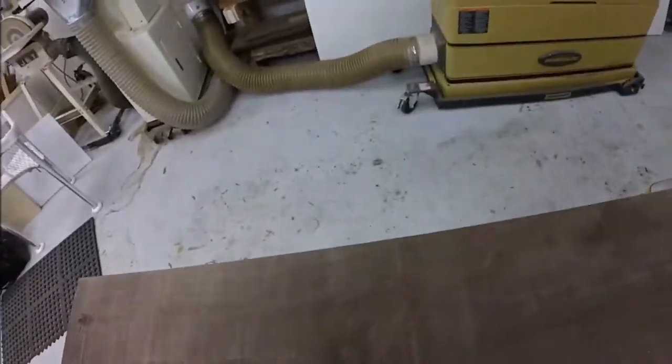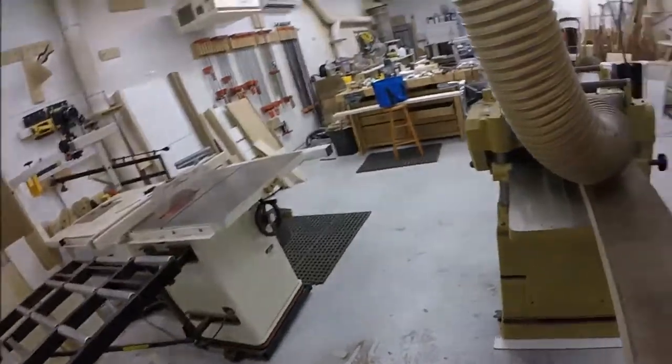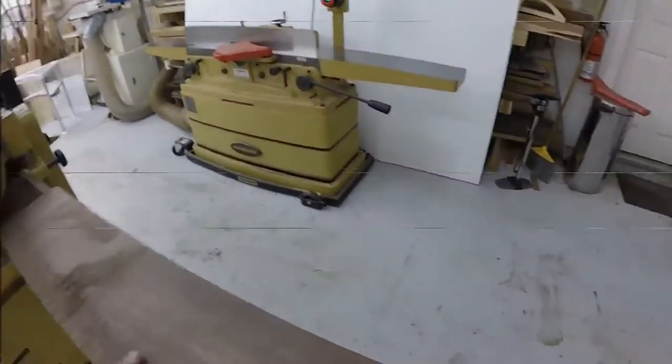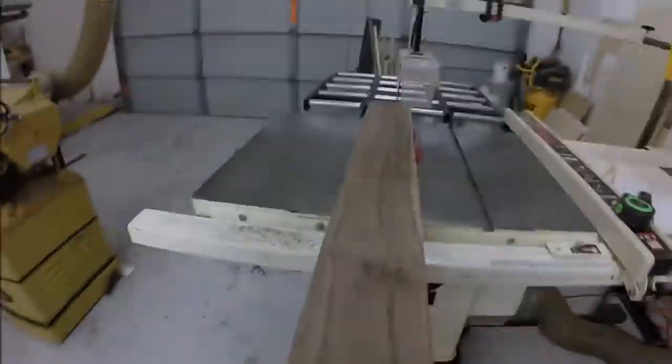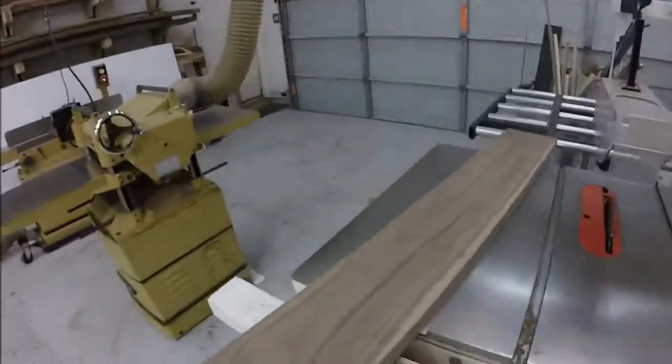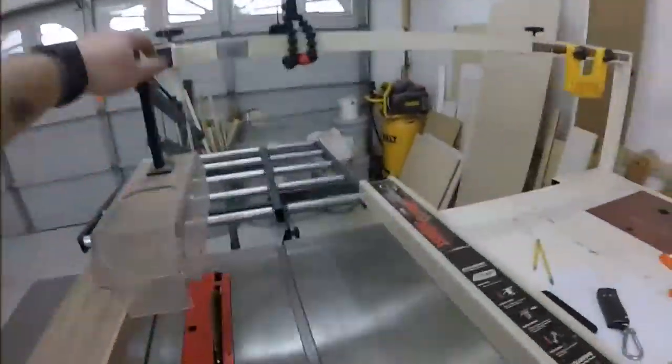Here's the planing process — you figure out what thickness you want for your wood. For this project I went with two and a quarter inches. That piece was two and a half inches, so I planed down to that desired thickness. Once I was done with that, I cut my pieces to length and size. My thickness is all set to go.